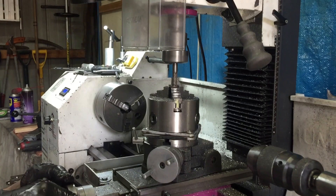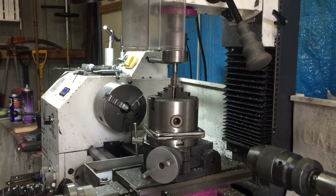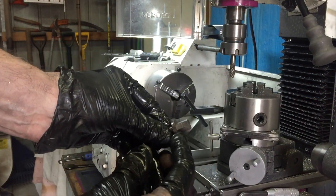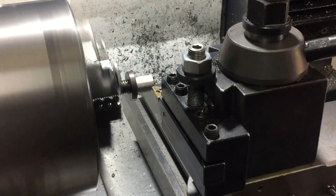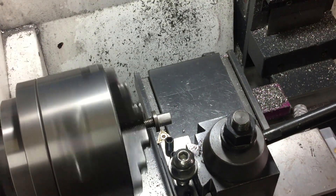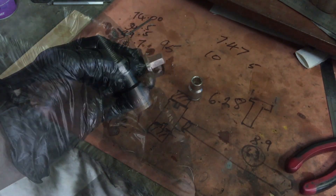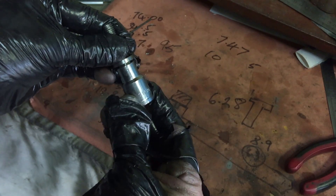I'm side milling the stainless steel to make the bolt head faces, and I've got to do it a little bit at a time. I can't do the cut completely because I want to end up with just an 11mm bolt head. Once I've got that, I'm just going back to the lathe to clean it up and put some little chamfers on it so that it's nice and smooth. And there's the bolt done — it fits the 11mm socket quite happily.